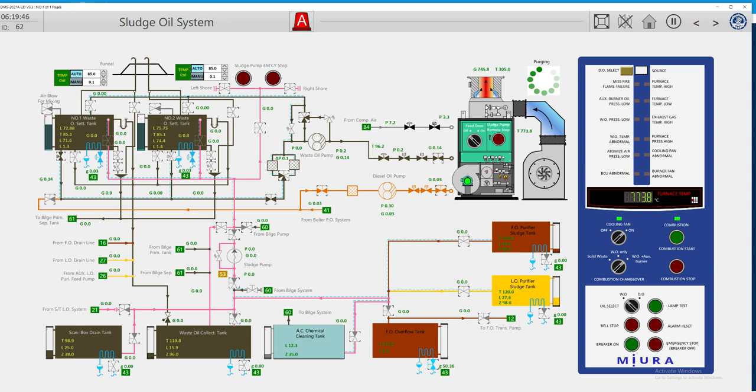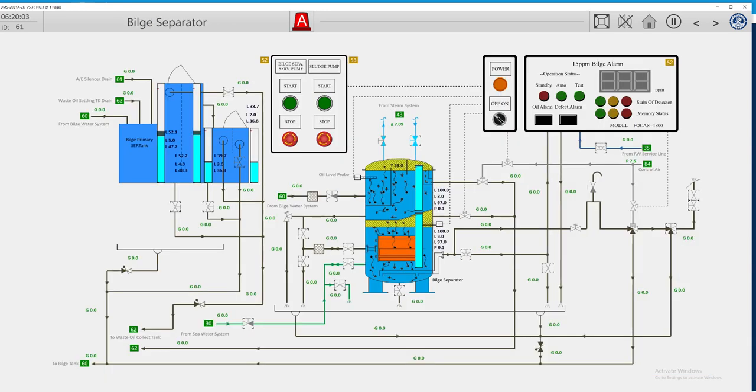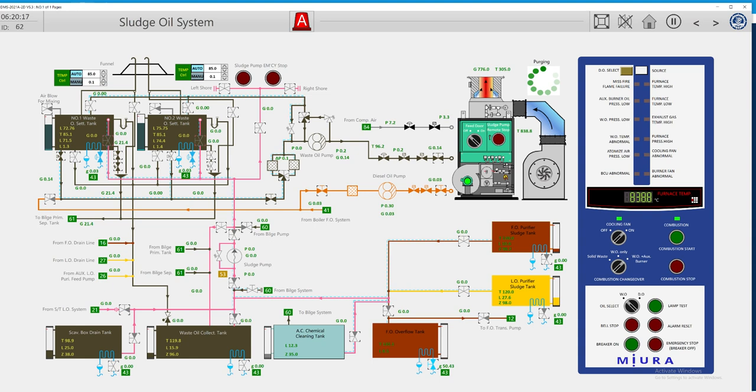Let's see if we have any water presented. We have flow — it's coming from the waste oil drain. This is probably water and oil. Let's drain again. There will be humidity here if any water is present, but probably the quality is not so good here.